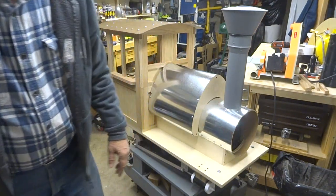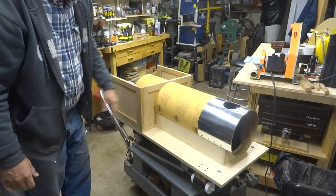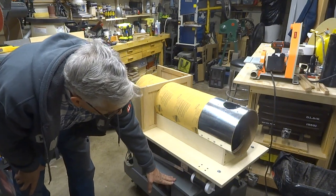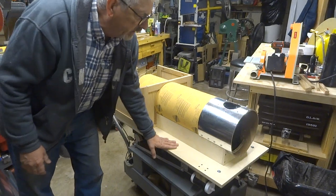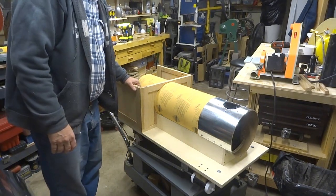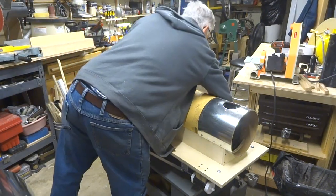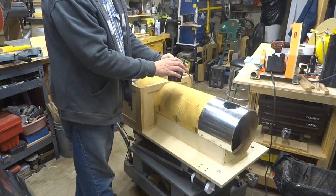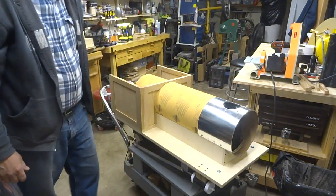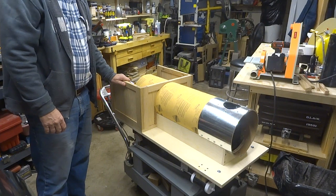So let me show you that. This is what it looks like when it has to fit inside the truck. This is a raisable and lowerable rack that I made — it's a hydraulic lift, so I can get this thing up to the height of the bed of the truck and shoot it in that way. I'm just getting started and there are a lot of details to be worked out. One of the big things I have to figure out is the control mechanism — it was originally set up to run on a tether with speed control, direction, lights, horn, and all that, but I'm going to build those controls into the cab, very similar to how they would have been done on the actual steam engine itself.